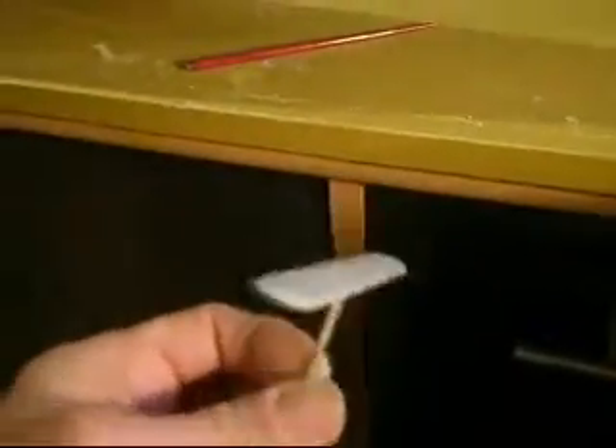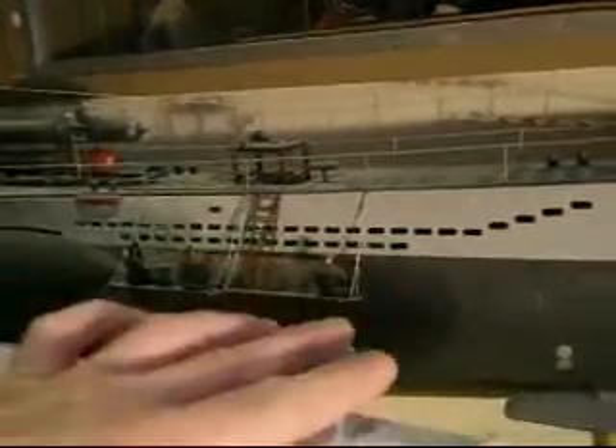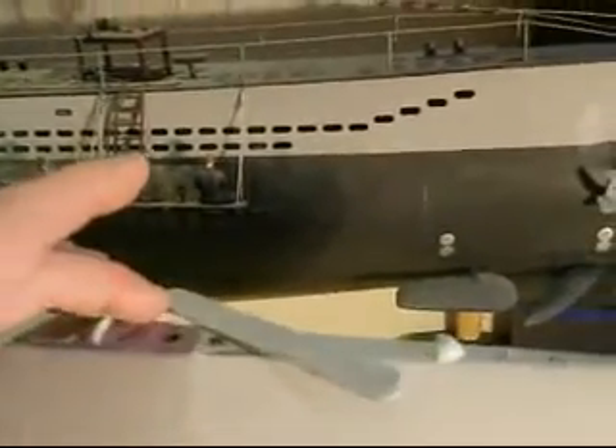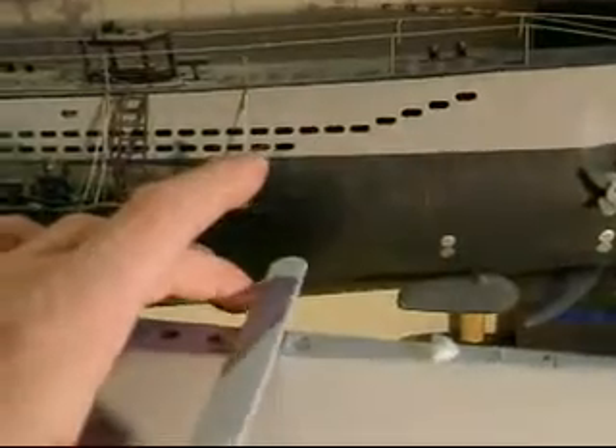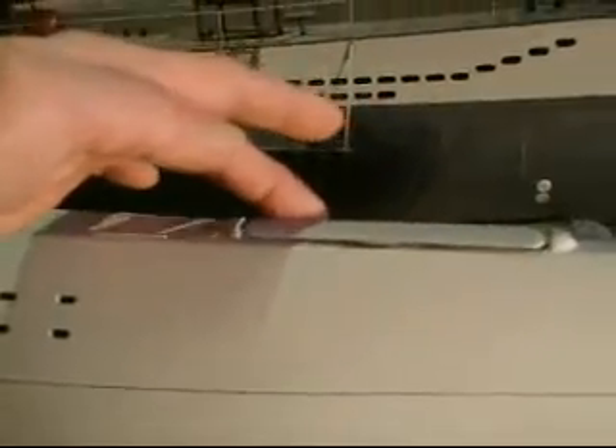I already made this on the rear side as well — the same thing. And then you've got this: a special kind of wing — it's a stabilizing wing. They had some issues with the boat at low speeds; it was unstable. So they added a wing thing like this that can rotate. At low speeds it's extended, and at high speeds you don't need the wing anymore and it will turn in.